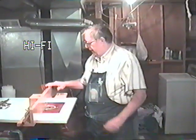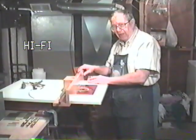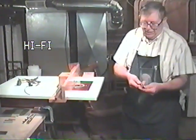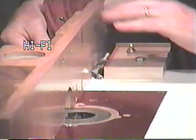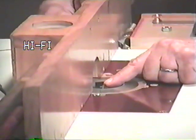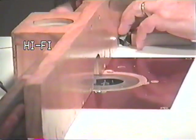Now that we understand that we actually set the center of the bit to half the distance of whatever we place between the locating post and the fence, we can use that to accurately set off any job. For example, using an accurate drill bit — in this case a three-quarter inch bit — if I set it here and snug up the fence against the bit and clamp it, I then accurately set the drill bit center, or the center of the router bit, three-eighths of an inch from the face of the fence.